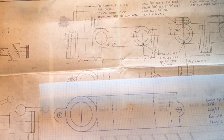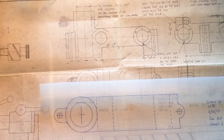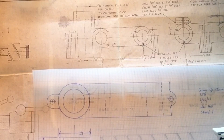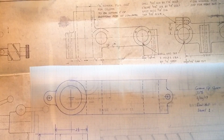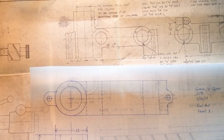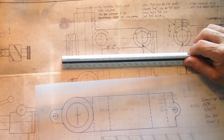In the home shop a lot of people are now using carbide. When this machine was originally designed, everybody was primarily using high-speed steel — the advantage being you can grind it in your own shop. These days we're using a lot more carbide, and primarily for carbide we're using diamond wheels. There's some green-wheel grinding, but we've mostly gone to diamond wheels. The availability of diamond wheels in a size suitable for this machine is almost non-existent. I have a diamond cup wheel with an arbor built for it, but I don't feel like the original machine has enough size or horsepower to really handle that diamond wheel — and that's one of the primary reasons for upscaling.